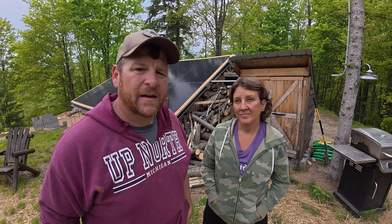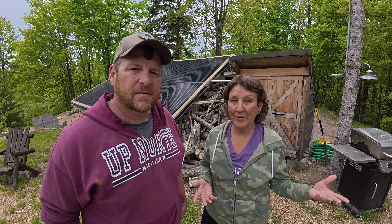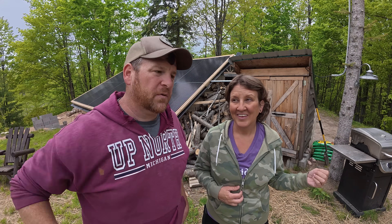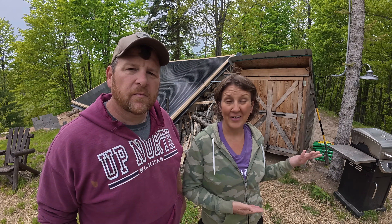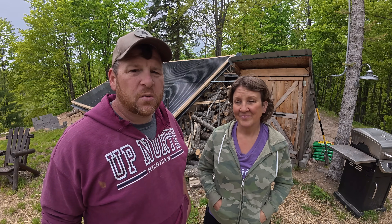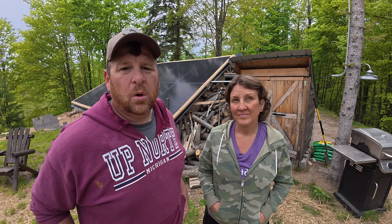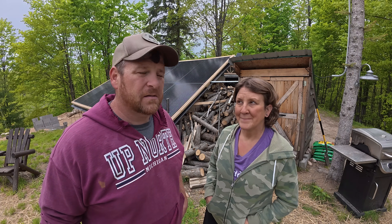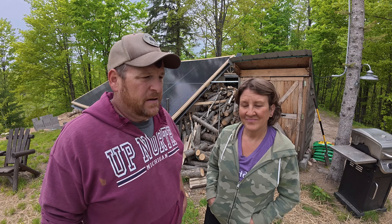Not only is this a 24-volt wind turbine and we have a 48-volt system, but that 24-volt turbine was only pushing about 50 watts max at 10–15 mph winds. A lot of you suggested raising it or moving it, but we can't really move it — this is the best spot, next to the solar and batteries. Running lines hundreds of feet would be inefficient. Raising it would require expensive towers, anchor lines, or heavy equipment, which we weren't willing to do since solar works well for us.